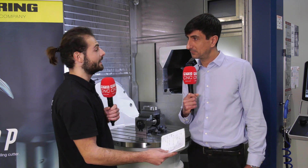Surely it can't be that quick? You were saying earlier that 20 years ago when you were running machines you would run a reamer at a fraction of the drill rate. I was always taught during my apprenticeship by my old foreman to run at one third of the speed you drilled at. And you're running at 10 times that feed rate with this — it's more like a punch than a reamer. When you see this working, it runs at phenomenal speeds and nothing compares in my opinion.